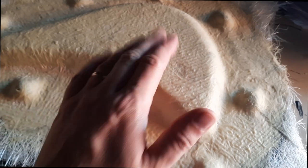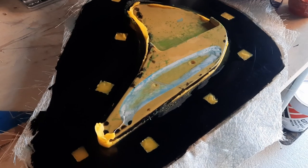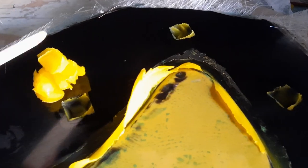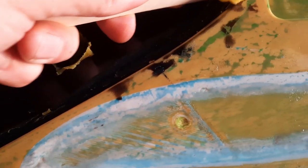Here we are the following morning - once it's all cured it's changed color, gone to this lovely baileys cream. We now have to peel off that barrier revealing the tooling surface. Obviously you want to keep the part - the buck - in place ready to take the next mold, so you've got to do the second side. All the retaining features and indexing you see around the outside can be fished out, it's effectively a soft wax that can be used again and again. A simple lollipop stick is good enough to clean out the worst of it, then give it a prod to free up any remaining wax. Then it's time to clean it all down, scrape away any of the filleting from the sides because we want a nice crisp edge onto the mold, and give that a coat again.